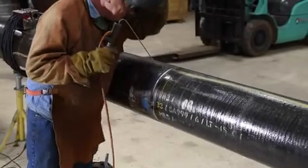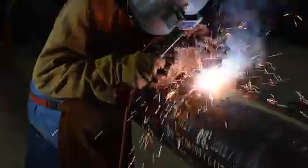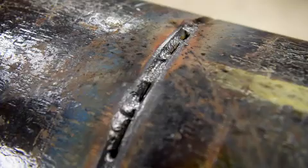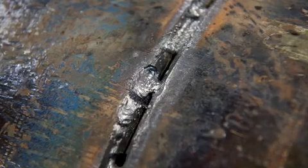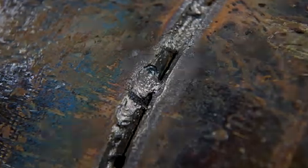Stage 2: The welder is now all set and will attempt to weld. You can see that the welder could not strike a consistent arc and the sound of the welding arc was noisy and erratic. The result of the magnetic arc blow is that rather than a smooth weld fillet, there is weld metal splattered around the weld prep. The resulting joint has poor structural integrity and will fail non-destructive testing and will have to be ground out. At lower magnetic fields the effect is not so marked, however the joint will not be even where the arc has wandered, and there may be issues of poor fracture performance and inclusions.